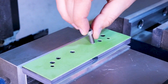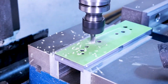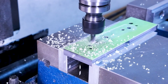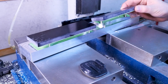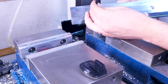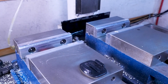I check the threads and dowel holes for fit before moving on just in case — if we catch a mistake here we can still fix it. I also like to add a 20-thousandths deep relief which is inset from the tang about 150 thousandths, and this will seal the perimeter of the scale against the blade six times tighter just to guarantee that no dirt or moisture make their way in. Now we've got all the features we need to hold the stock to the fixture plate. Again the dowel pins let us accurately locate the stock and the threaded holes let us bolt the scale down from the back. Now the scales are rigidly held in position for final machining and everything should come out aligned perfectly.